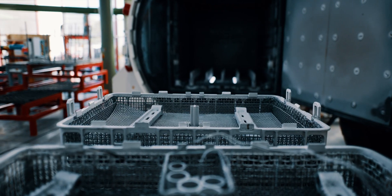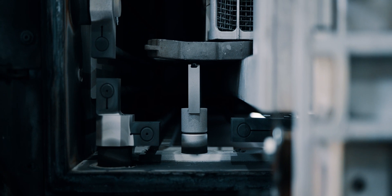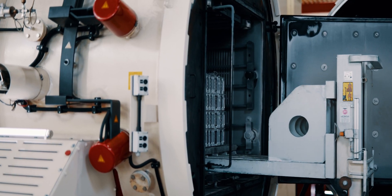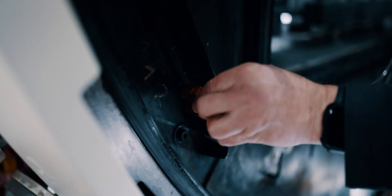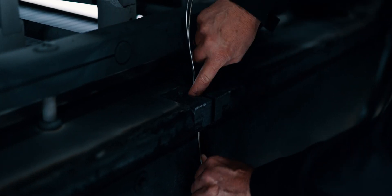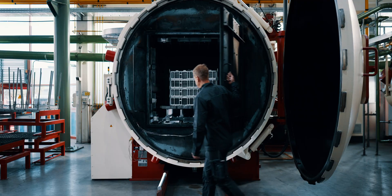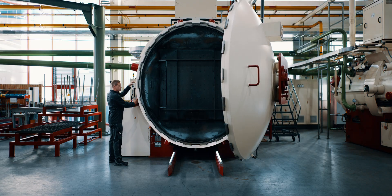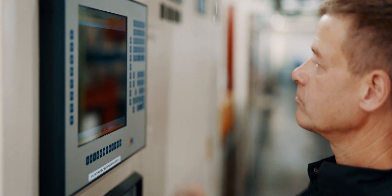The hardening process takes place at a temperature rising slowly up to 1200 degrees Celsius or more. An accurate temperature check prevents excessive temperature differences in the workpiece, which cause warping. The hardening process is initiated by quenching with nitrogen; to prevent warping in larger workpieces as well, a temperature compensation setting is applied.